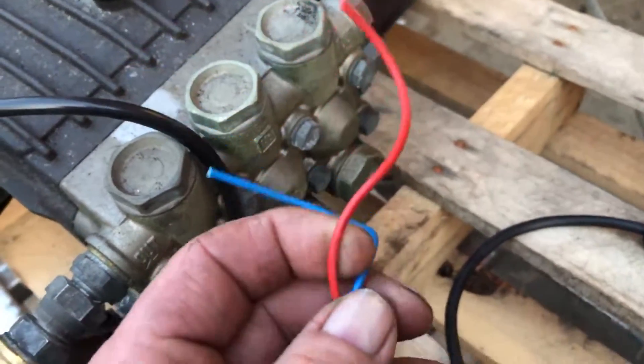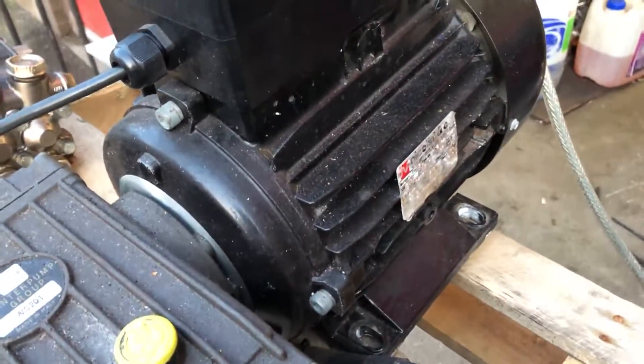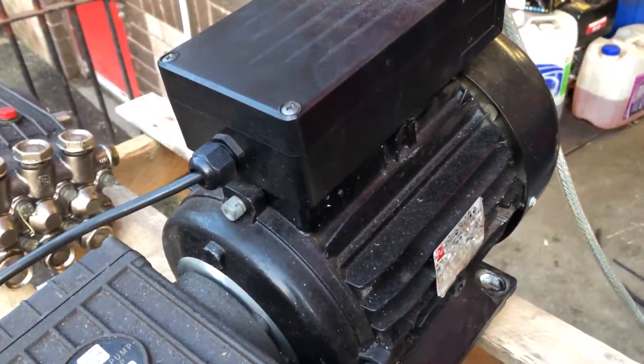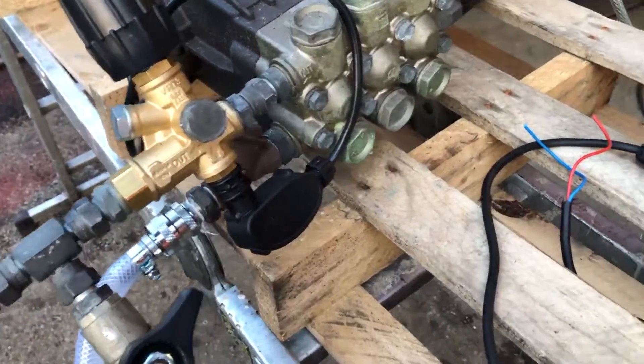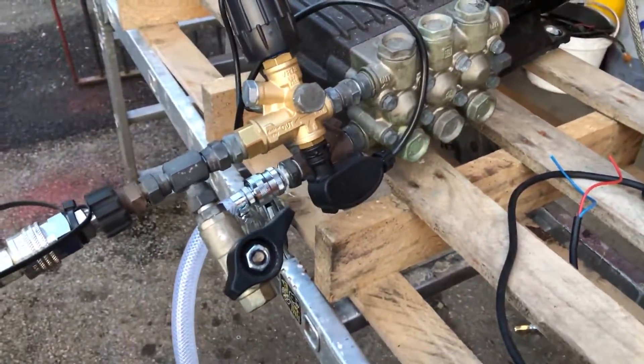We've also got a thin cable. If you look at the cables coming into the machine itself, we've got three cores coming in — 240 volt on each phase, three phase. On this side we've got this tiny cable that's meant to cope with the amperage the motor is pulling. There's no 24-volt step-down transformer or anything; it's carrying the same amps as the motor. Every time it jump-starts, that switch inside is meant to cope.